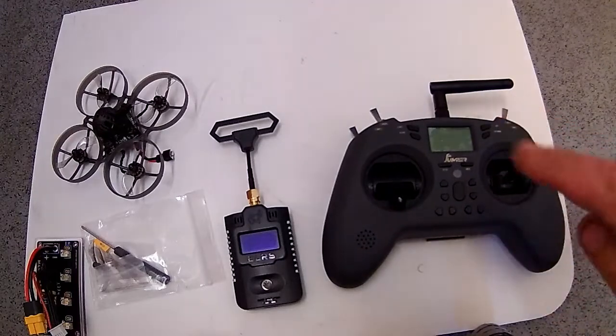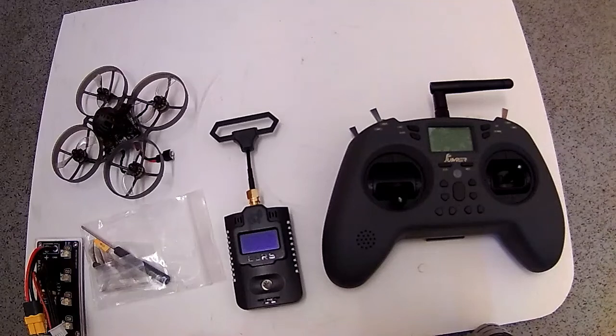All hunky-dory, works lovely. I took this for a flight the other day — I was rushing and mucking about with things — and I realised I couldn't tell what milliwatts I was on for the VTX. I had to go back into BetaFlight and set everything up. I've got it down to 100 milliwatts to save battery power, and when I disarm it will automatically go down to 25. Otherwise this gets very hot, and if it's just sitting there idling it'll get hotter and hotter and you'll get a brownout — I've had that loads of times. So I set it so when I disarm it goes down to 25 milliwatts.